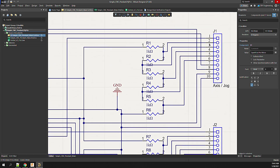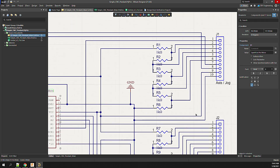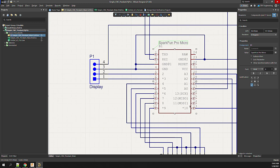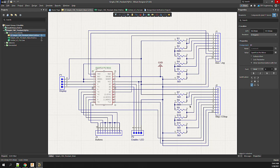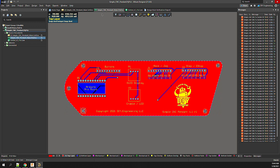The resistor ladders basically act as a six-step voltage divider. This means that the rotary switches will only need a single analog I/O pin instead of one for each of the six options. The display connector will leverage the I2C pins, and the rest of the buttons are connected to digital I/O as well as power and ground. The schematic is then automatically annotated, changes are validated, and an ECO pushes the updates to the PCB file.